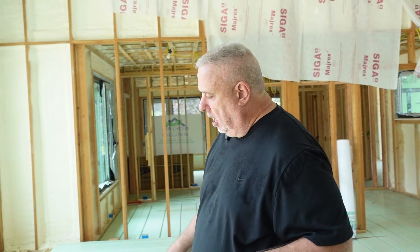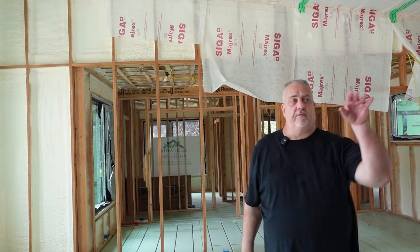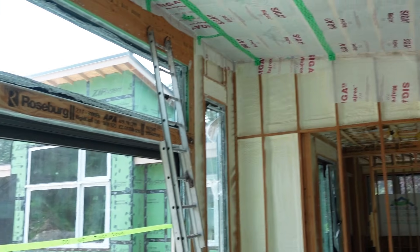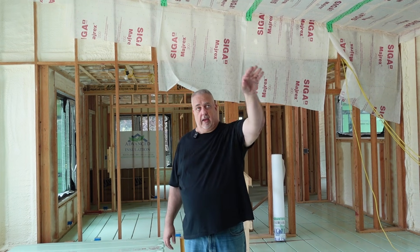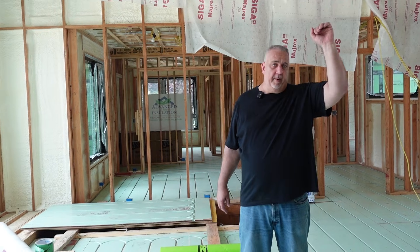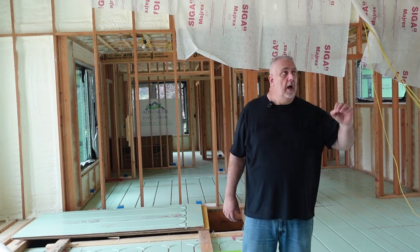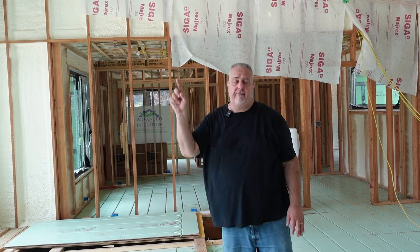This house is a mixture — we have some flat ceilings and then we have monoslope ceilings in three different locations. In two of those locations inside the house, the owner's suite and the great room here, I chose to go with a vented roof assembly. We have monoslope trusses that have a cord down in the bottom. It's not really a parallel cord because it's sloped, but it's sloped half of the 4 and 12 that the main roof is. So this is about 2 and 12 on the inside here, but it tightens up down at the end there and certainly expands to almost about 5 and a half feet up there.